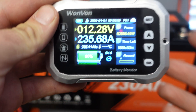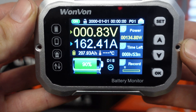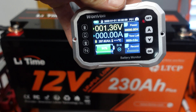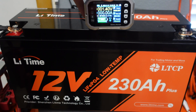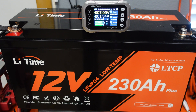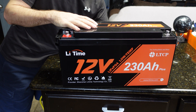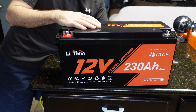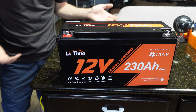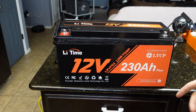The battery is doing awesome — this is unfortunately the most I'm going to be able to get out of it. We did hit the over-current protection; the battery shut itself down, which is a good safety feature to see actually working. A lot of the other batteries I've been testing have not shut themselves off, but this one did. It pulled over 230 amps for about two or three minutes no problem. It kicked back on quickly and is back up to voltage. Now we're going to open this thing up and look at the insides, the build quality, and the BMS.